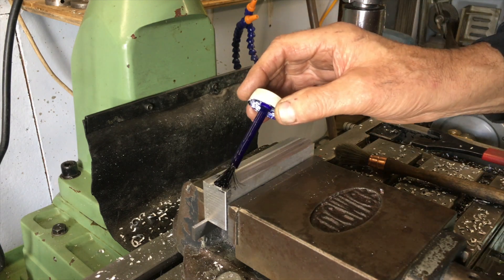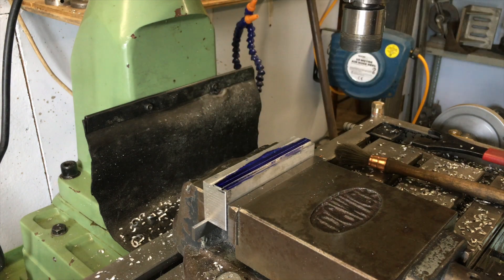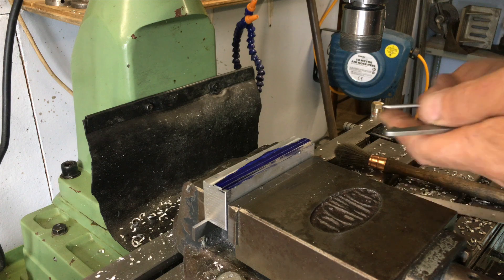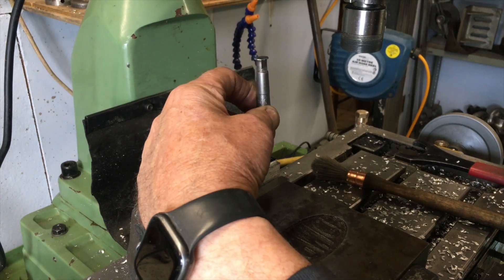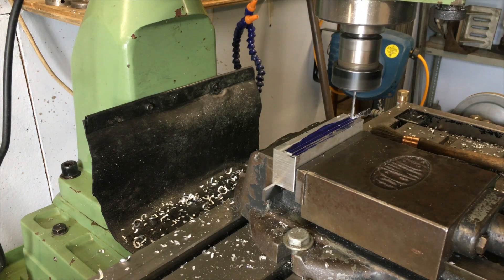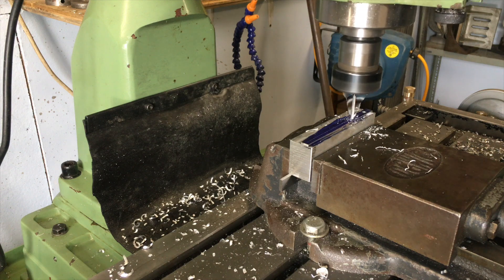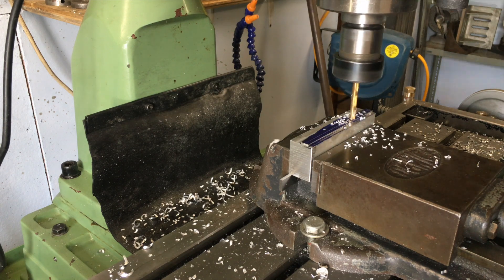Fettling completed, I got on with establishing the position for the two holes for the dovetail locking strips. The dovetail locking strips I already had from an old project, so I didn't see the point in making any more. One thing I had to remember at this point was that both blocks are left and right handed. As usual after marking out and spotting, the drilling started with the pilot and then finished with a clearance drill. The eagle-eyed of you will notice that the pilot drill isn't to full depth — it didn't matter because the clearance drill is long enough and I've got to drill an even bigger hole from the other side anyway.